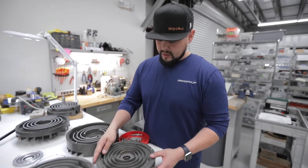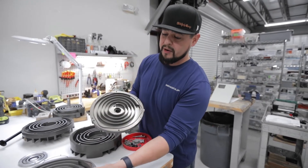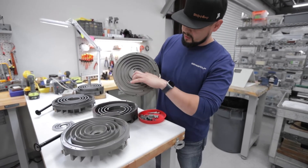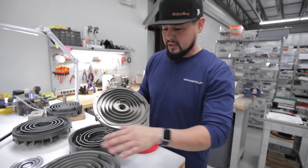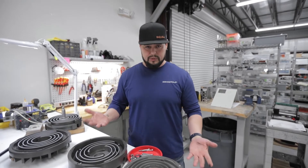After we've tested the vacuum pump initially to find out what level of maintenance we need, we'll break down the pump into the different housings of the module. As you can see here, some of the modules come in really dirty and they'll have worn tip seals on the inside, which creates a lot of dirt and prevents the base pressure from reaching the low base that the customer requires.